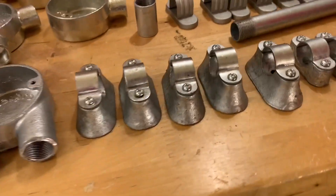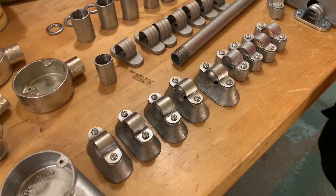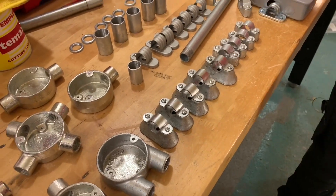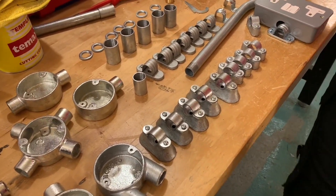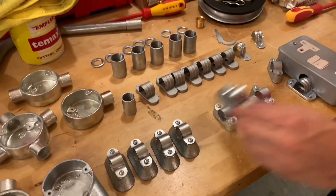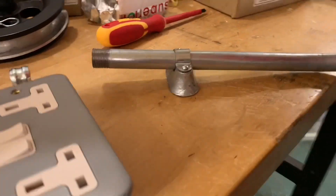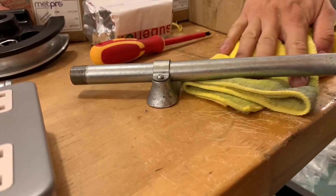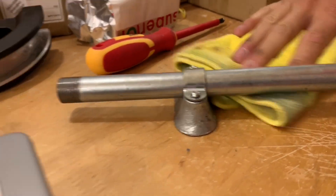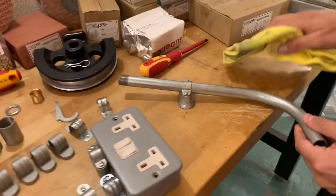This really big one at the back is a hospital saddle. Despite the name, it's not exclusively used in hospitals — it's used in high hygiene areas such as some areas of hospitals and canteens. With a piece of conduit in it, it bridges the conduit well off the surface so a cloth can get underneath the back side as well as all the other sides to clean it easily.